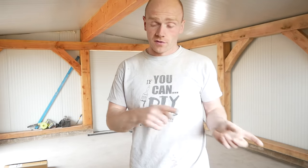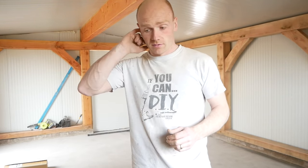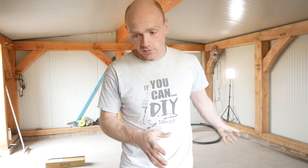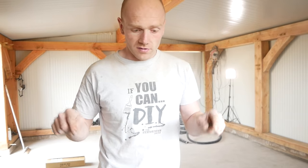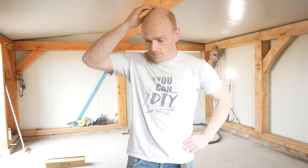This whole process wasn't really necessary if you'd done a proper job in the first place — when you shutter and pour the concrete, your levels at that point dictate everything. At that point I didn't have a laser level or any sight measurement tools, just a six-foot level and a builder's square. It must have been about 20mm lower over one side. Anyway, I'm my own worst critic and we spent an extra day on it — it cost about £180 to get all the self-leveling in here. If your concrete is fairly sound you could hire a big floor grinder and grind it down ready for epoxy. Otherwise if you've got to self-level anyway it kind of means you can avoid the hire, although you've still got to prep the self-leveling surface.